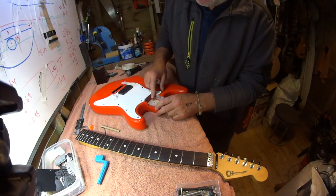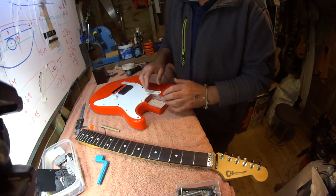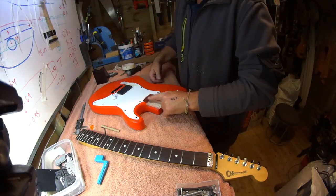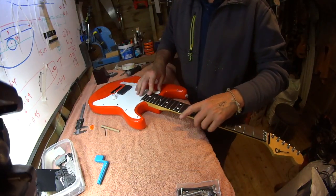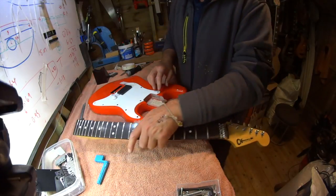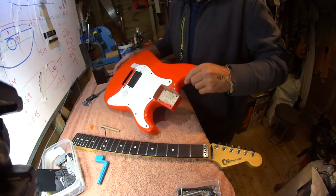And if you get the right amount and you mask all of this off, what you won't get is any spill or anything showing through. But that would give a much better chance of wood-to-wood contact. In fact, it's probably just as well to pull it in with the original screws for now. And then what I'd do is replace those once we've created that flat level. So that's what I'm going to do, I tell myself.